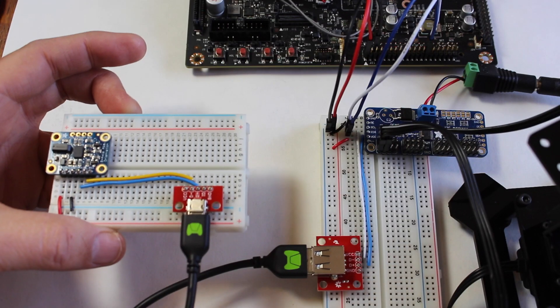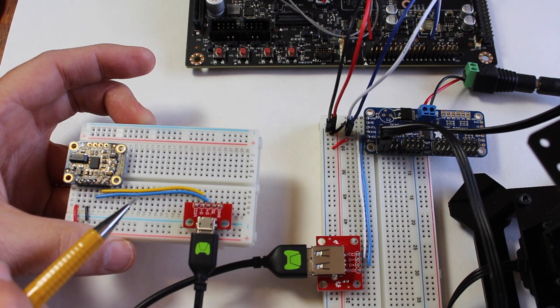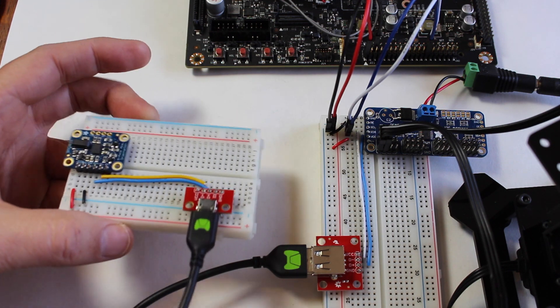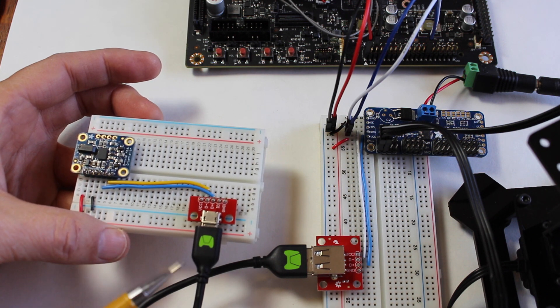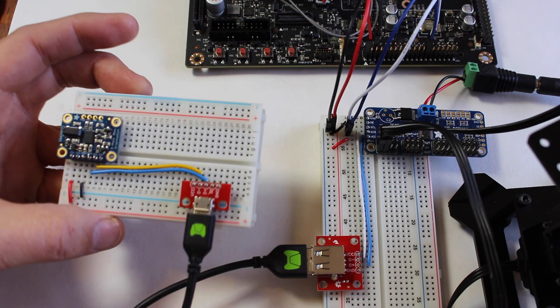One of the applications for this type of setup is that you have an IMU that runs on a camera gimbal. The gimbal senses the position of the IMU and compensates the servos accordingly so that the camera remains stable. Some camera gimbals use servos, but more than likely they have brushless gimbal motors now — they're smoother and quieter.